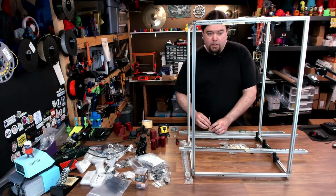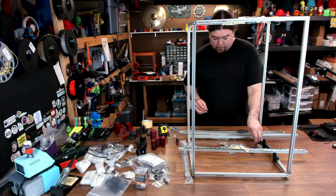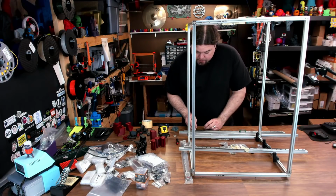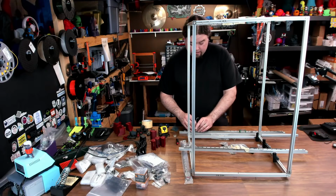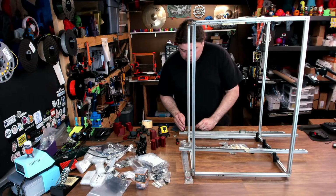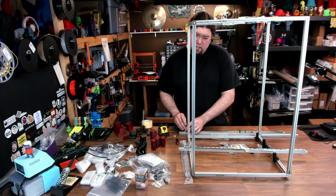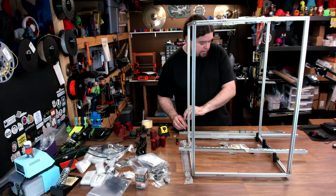Aaron F, yeah, if you're only using one environment, if you only have one board, just go ahead and set the default environment and forget about it. That's fine. You're right, you can use the build buttons. But to use those build buttons, you also have to have Git. And believe it or not, some people just aren't used to that kind of thing. It's throwing an error that you need something else. If you build from the direct environment, it will know how to grab the library without having to run the Git command, depending on the library. Just a fun fact, if you ever see an error like that.